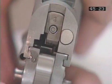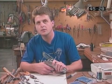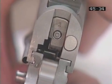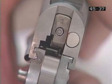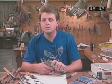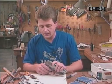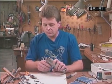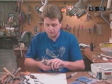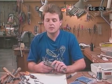The way to check it is to take the take-up out of your trigger and see if your 80 series lever pushes your plunger up. And it should, with the take-up out of it, run up there probably 20 thousandths. You need plenty of movement in it to make sure it functions all the way. This one pushes it up far enough out of the way that, as far as your 80 series parts are concerned, it's safe to go ahead and snap the gun.